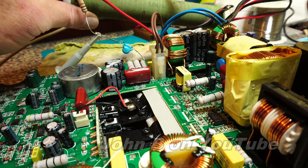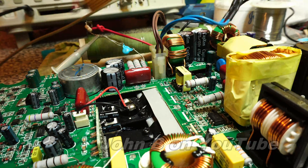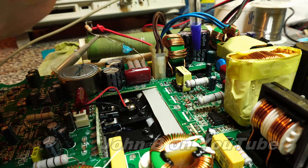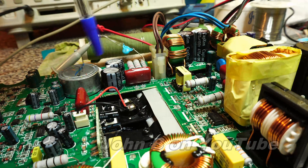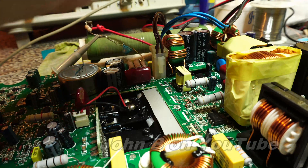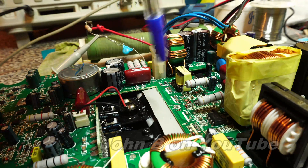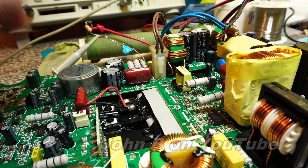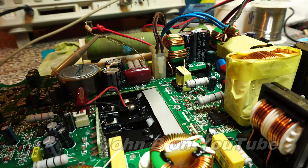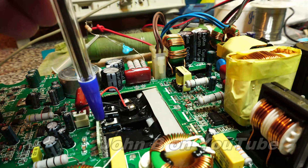I'll be driving this amplifier straight into a 4 ohm 100-watt wire-wound resistor; the treble circuit uses a smaller resistor. This amplifier has a plus and minus 75 volt rail for the bass. I cannot turn my waveform generator up fast enough to reach plus and minus 75 before the circuit starts limiting. But in reality, if you're a DJ with thumping bass happening quickly, you'd get a higher peak than I can demonstrate here. So 150 volts total peak to peak — that's what I'll be measuring today on the bass circuit.